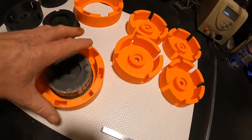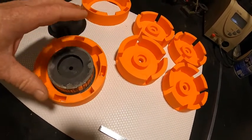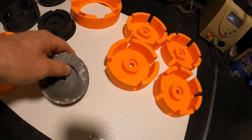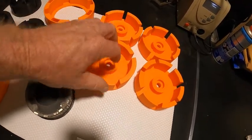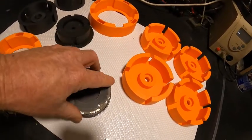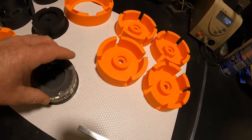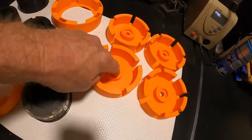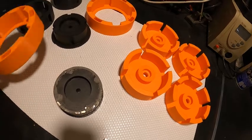It's being designed so it's simply going to be a system that you bolt together — I'm not going to have to make any parts for it. Kits will be coming as such. Once we've done our initial testing, I will be making up the rotors and stators with bearings to go in the inner stator. The shaft is fixed to the rotor so we can drive loads off it. For testing purposes, I simply slide it off and slide the next rotor on rather than pushing shafts in and out of each rotor.